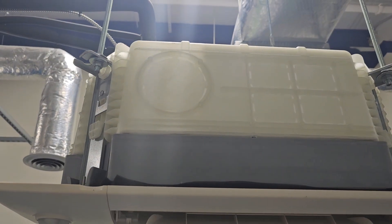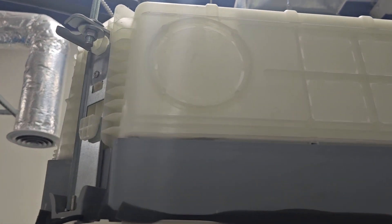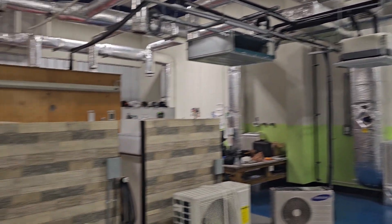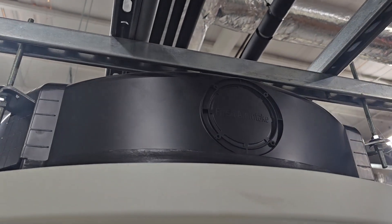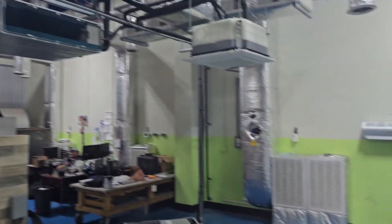Just like the four-way ceiling cassette, if you plan on installing the 360 ceiling cassette in your ceiling, you need to have access above the ceiling to get to those copper connections in case you have an indoor coil that has to be replaced. There is also a 3-inch knockout on the cassette body above the ceiling where you can add fresh air — about five percent fresh air — which is important for foam-insulated homes or spaces with a lot of gas appliances.